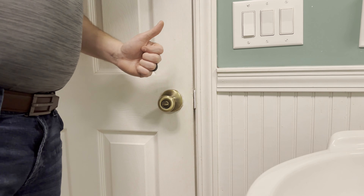If the screws are really loose when you go to attach the door striker plate, you'll want to get longer screws. Make sure the replacement screw is the same width and type — just a little bit longer. If you're doing an exterior door, I would highly recommend going up to a two or three inch screw so that the screws go all the way into the actual framing of the door.